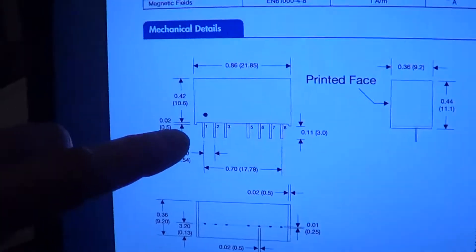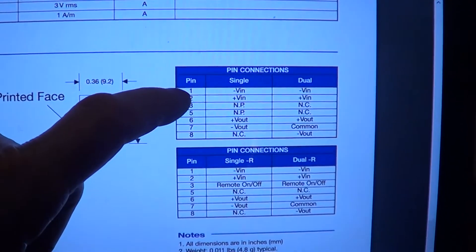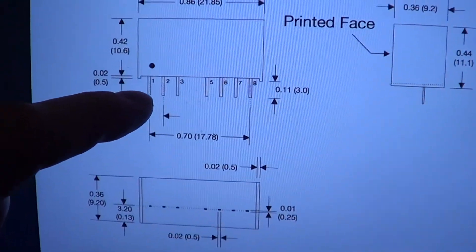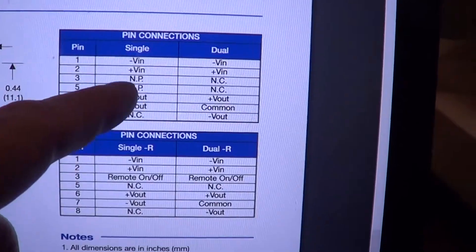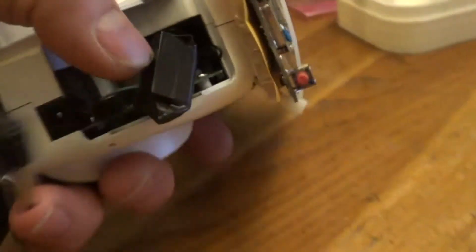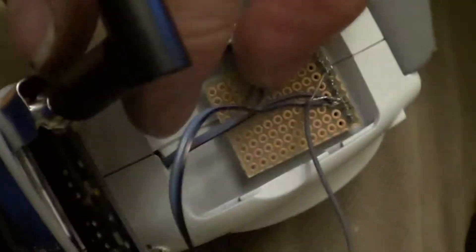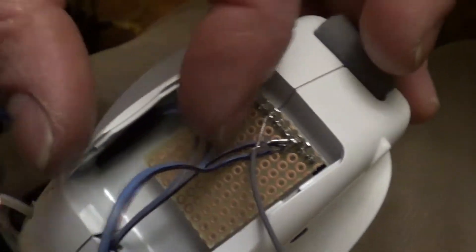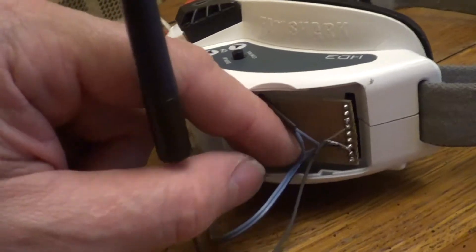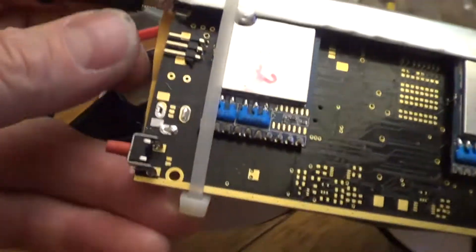Here's the diagram. You can see pins 1 and 2 are your V-in. You want to jump pin 1 to pin 7 — just a little jumper there — because this is an opto-isolated input, which you don't need; we're using a common ground. I've already taped it up. Basically I've got my two wires in, and then I run my two wires out to the other side, then I go to pin 3 which is ground. I haven't put on my power-off circuit yet, but I'll have to do that. Right now I'm running the 9 volt all the way into my ClearView circuit board.